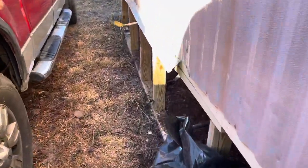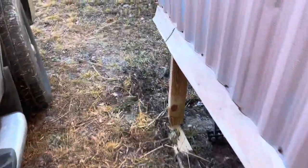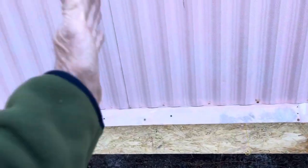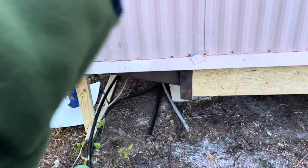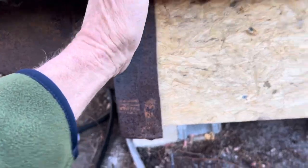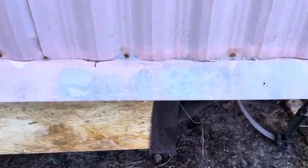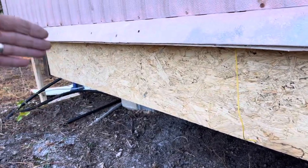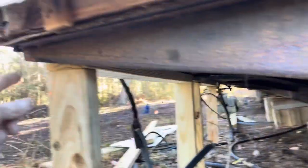Someone asked me a question on my YouTube channel about floor joists. They have two-by-six floor joists that run straight down the house lengthwise from one end to the other. The last joist sits on the end beam, and they fill them in every 16 inches. In order to hold the outside walls up, because the floor joists run vertical rather than crosswise, they put these cantilevers out like this — that's what holds up the rest of the house.